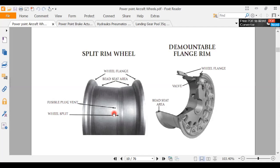What'd you say, Q? I was just saying, okay, that makes sense. I was wondering how that even happened. I just didn't even know how you would deflate the whole tire when it's hot like that. Yeah, it's called a fusible plug, and usually there's two of them, sometimes three in a wheel. So you don't want that thing to come apart like a grenade, because if the metal fails and you've got 300 PSI of nitrogen inside that tire, now you've got a bomb. Right, so a fusible plug is a safety plug for heat. It's a thermal relief.